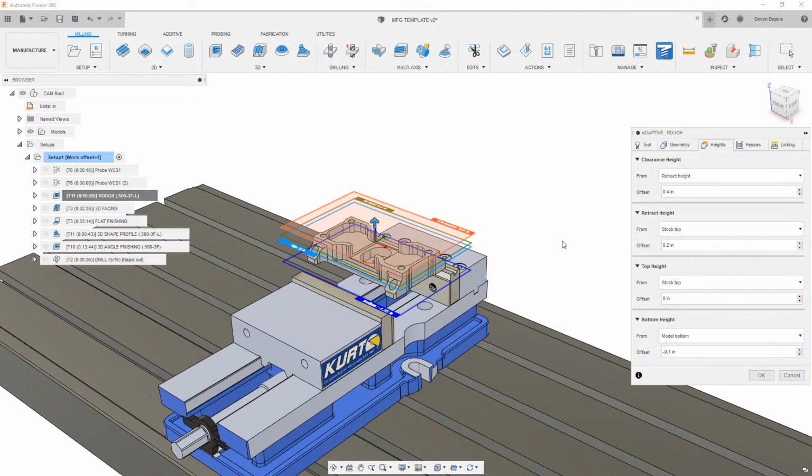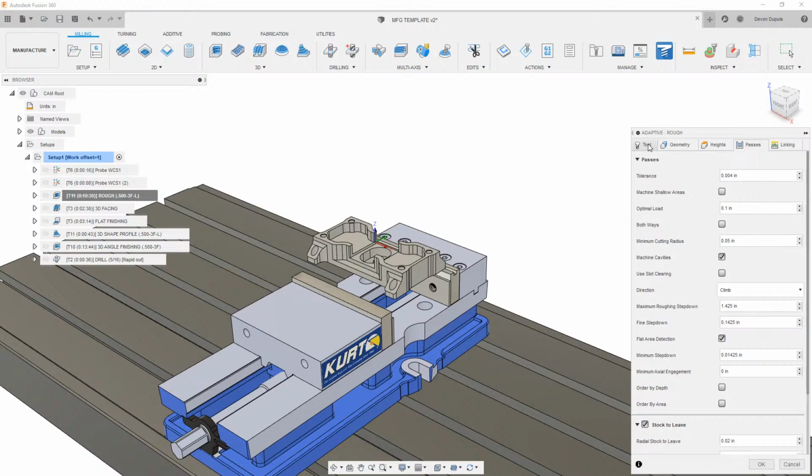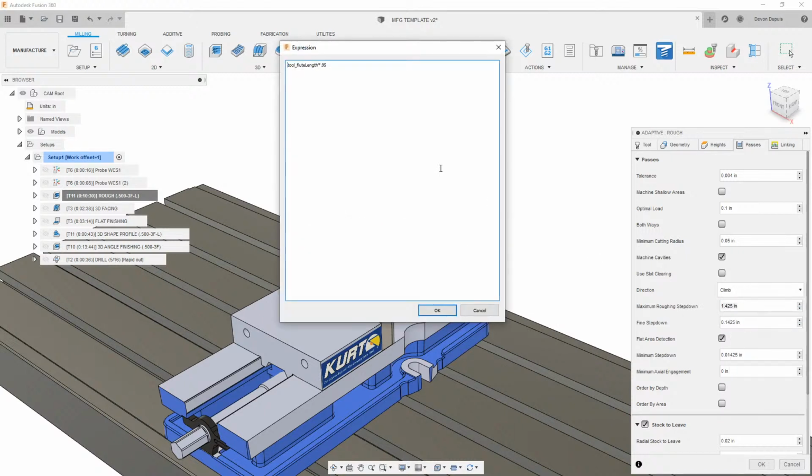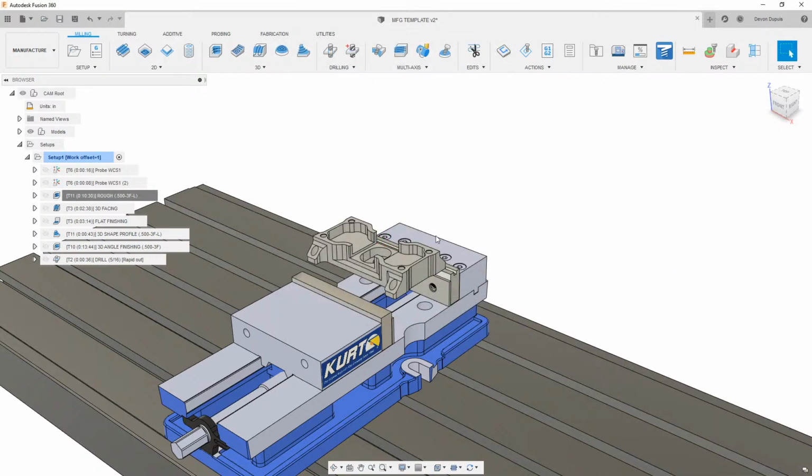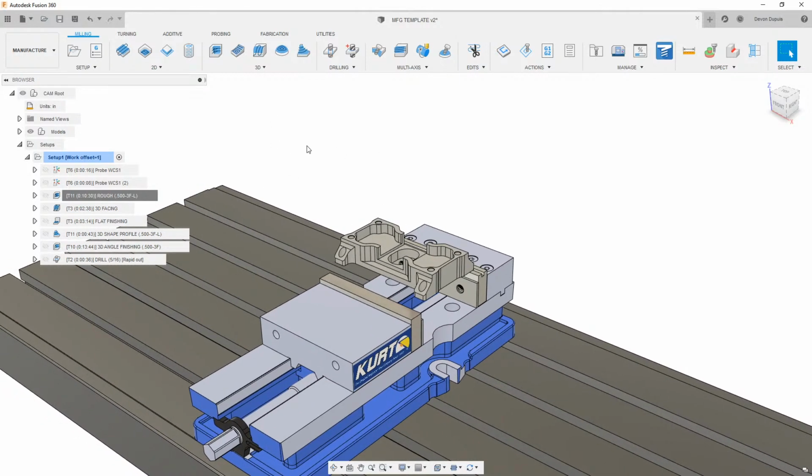And this one's pretty simple. You guys probably do this a lot. Obviously, parameters and everything in here. I have a tool that has an inch and a half length of flute. So I'm using those parameters in my settings here to drive what the steps and the step downs and everything are going to be. We can close this out, and that one's not super intense, right?